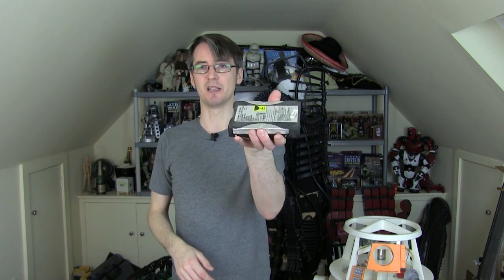The other sensor we need is a gyro. You can imagine a gyro being a bit like a spinning top, but if you've ever looked at a hard drive - I've got one just here - it has spinning platters that spin around really quick. If you've ever got a hard drive that's a motorized spinning disc, while it's spinning and then tried to move it, you'll notice that it feels a bit weird and it tries to resist your motions. So a gyro is quite quick to react - you can feel it as soon as you turn it - but it doesn't know which way up is. So what we need to do is mix the accelerometer and the gyro together. We've got the absolute upright position with quite slow data, and then we've got the fast gyro data, which has creep. We need to transpose that onto the accelerometer data, so we've got that fast motion on top of our slow accelerometer wave.